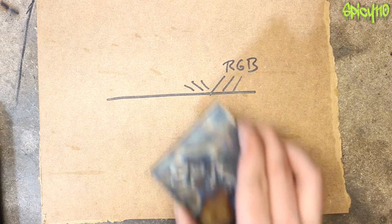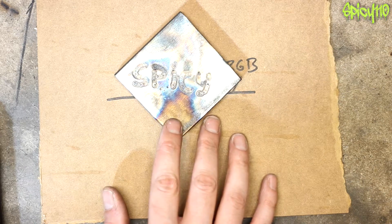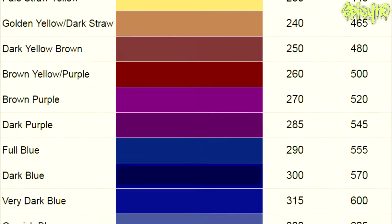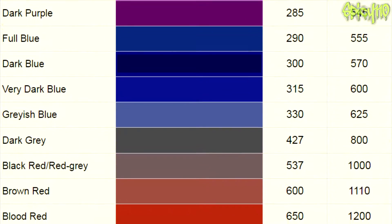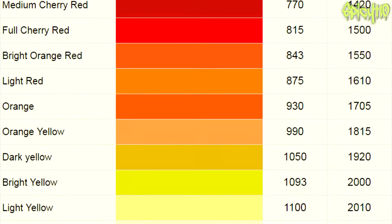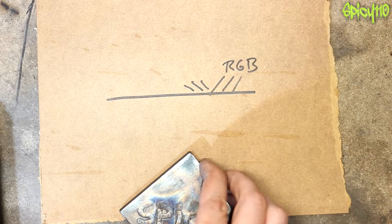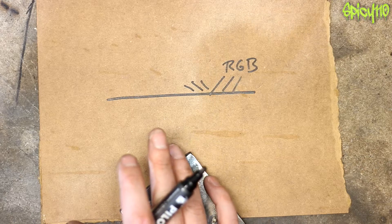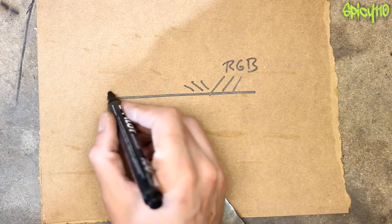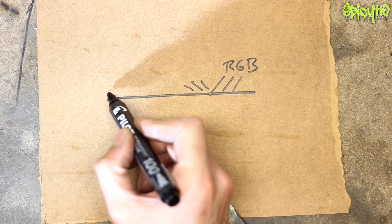So this is where we answer the question: why is this bit yellow, why is this bit blue? Normal carbon steel reacts with oxygen when it's heated to certain temperatures, as you're seeing on this chart — so you can tell what temperature the metal is depending on the colour it is at the time. That's why you're getting the variety of colours: different temperature ranges as the heat went through it. So let's say we heated the steel up to 270 degrees — we're going to get a purple colour, caused by the steel starting to oxidise.